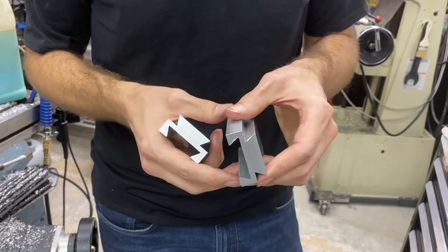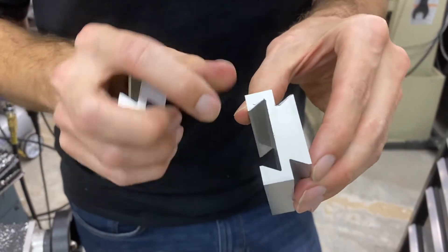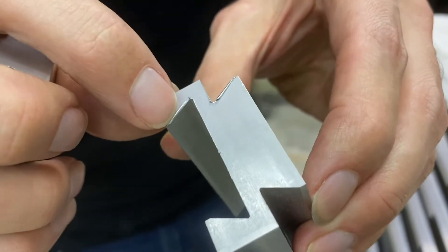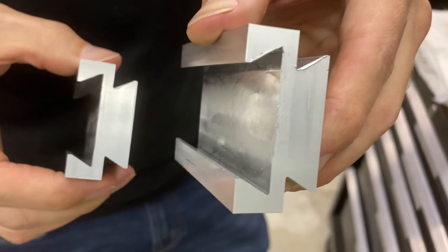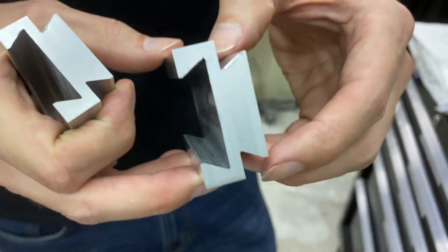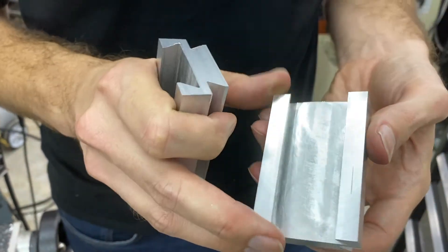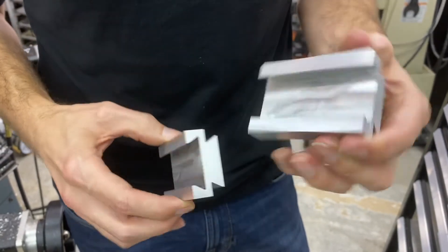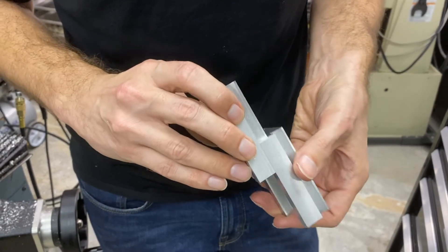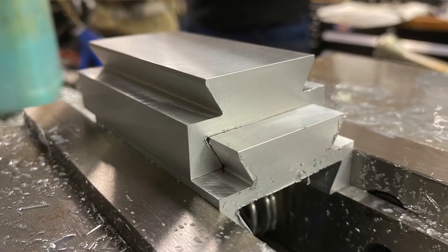This particular material is kind of weird. It is aluminum, but I'm not sure what it is — I just pulled it out of our scrap bin here, and it looks like some kind of cast aluminum. You can see the way it cuts and the way it has this edge that just rolls over and sticks there. Compared to the 6061 that I've cut with this cutter, this is a little bit softer and mushier, but it does give a decent finish and it's pretty easy to cut quickly. Dovetail slides are really something I've always found interesting — I like looking at them on older vintage machines, and I've always wanted to play around with making some and learning how to calculate the fit on them, or even making some with gibs.